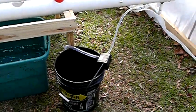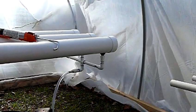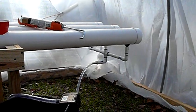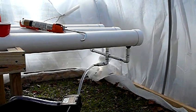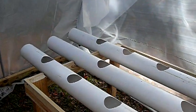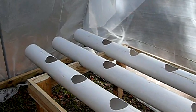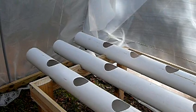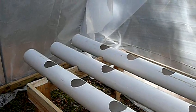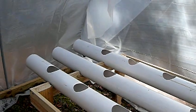Here's my pump. I'm pumping up through a header that goes into the bottom of the pipes on this end. I've got them tilted slightly down so that the high point on the system is on this other end. You can see there's also a connector that right now is not plumbed up on that end — it goes up through the pipe and through an O-ring. It's got a coupling on it right now, up to within about an inch of the top of the pipe. So that will be my overflow pipe.